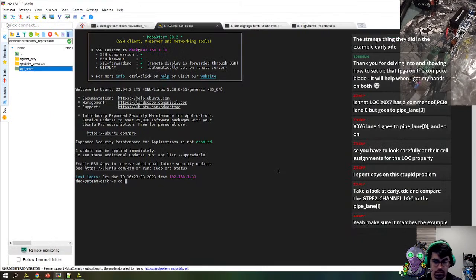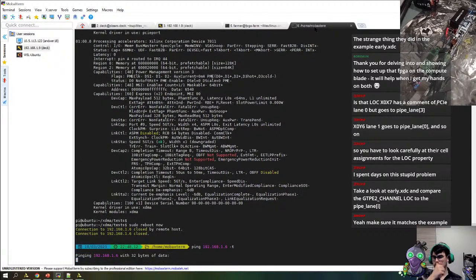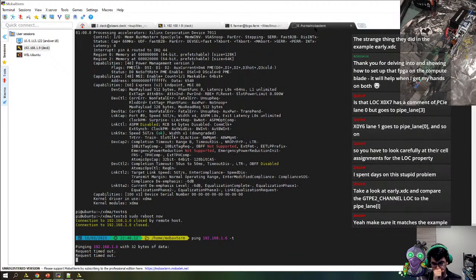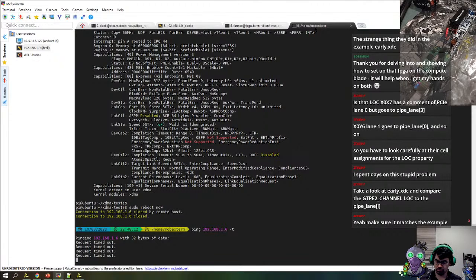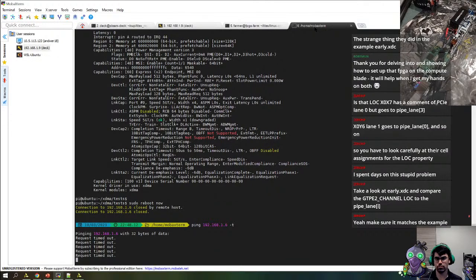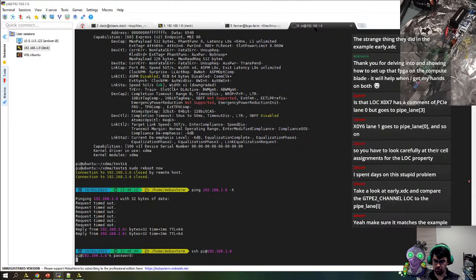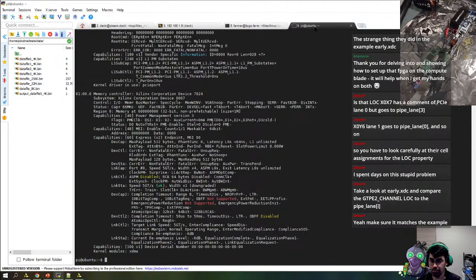And we'll reboot the Pi. Curious what that says. Then we can try to get the LiteX one working and then run a test. Okay, so going in here, sudo lspci. Okay, it looks like a generic Xilinx memory controller. These are just 4 lanes.